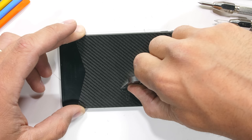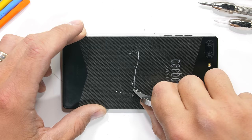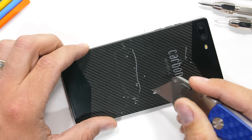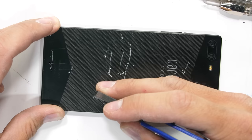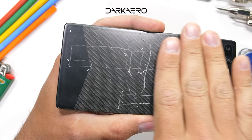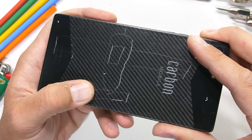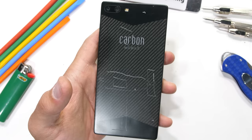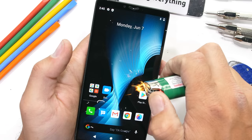Carbon fiber is lighter than steel or aluminum with 2 to 5 times more rigidity at the same thickness, depending on the fibers. That lightness and rigidity is why Formula 1 race cars are built mostly with carbon fiber frames and components — even the drive shafts. I've been following a YouTube channel called Dark Arrow that is building an entire airplane out of carbon fiber. The strength of carbon fiber comes from the direction the fibers are oriented. Carbon fiber is great for two-dimensional loads that align with the fiber direction, but once you add that third dimension of stress — like the stress from a bend test — carbon fiber is just not designed for that.